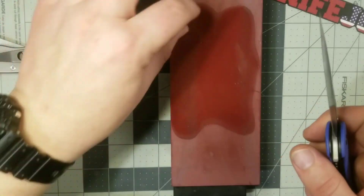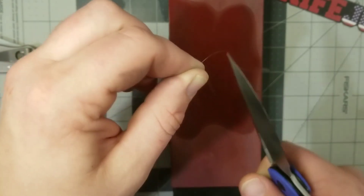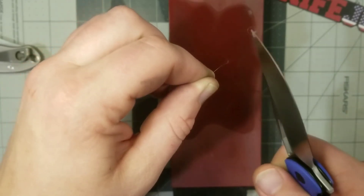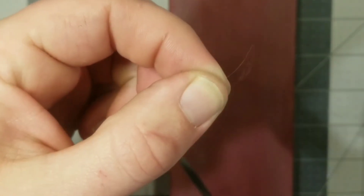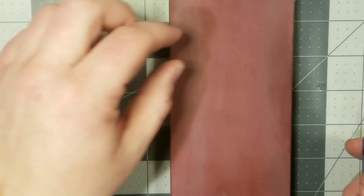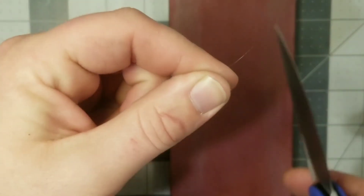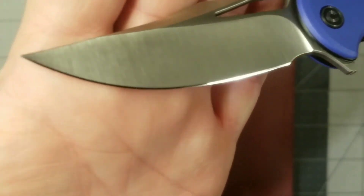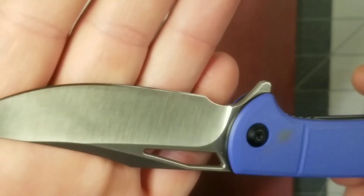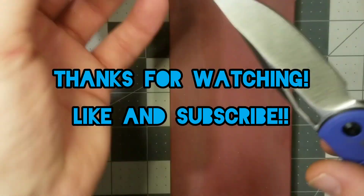My initial impressions of this are that it's very easy to sharpen. It cuts the steel away very quickly in comparison to some other steels. It takes a really good-looking polish and takes a really good edge. It actually seemed to have a good little bit of aggression at the end of the sharpening — the apex still feels fairly sticky and aggressive, which I'm pretty happy with. Here it is against another hair — absolutely hair-whittling sharp off the 1-micron strop. If this steel proves to have the edge retention that people purport it to have, then I think it's an excellent budget steel, especially on a knife this inexpensive. Let me know what you guys think of the 9CR if you've used it before — interested to hear other people's thoughts on sharpening it and using it. Thanks for watching, hope you enjoyed, and we'll see you next time.